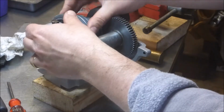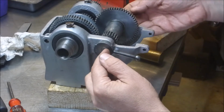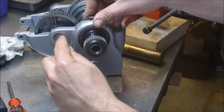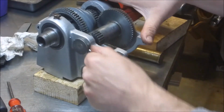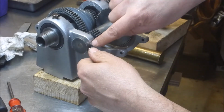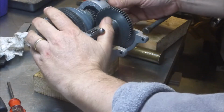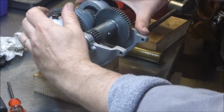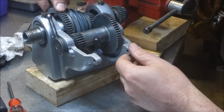So anyway, the way the back gears work, there's an eccentric shaft held eccentrically to the pivots. So this is the positive lock because there's a detent ball there. Pop it out of that, and then it has to feel its way into where this gear and this one mesh at the same time. It's in back gear now because this is disconnected from this guy.